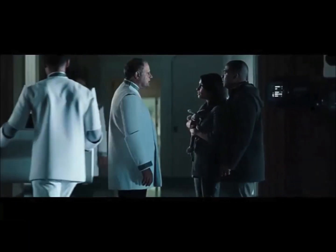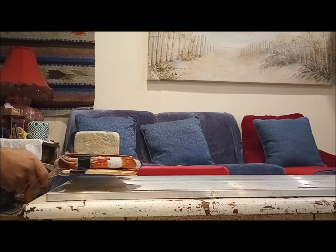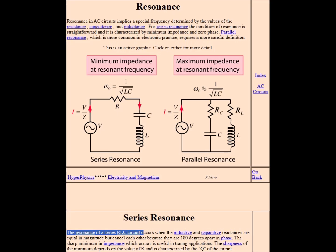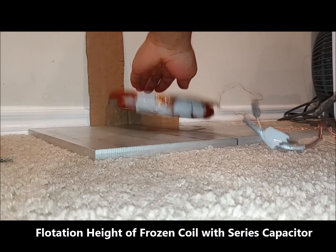In previous videos, I demonstrated the ability of maglev to mimic the flotation characteristics of various anti-gravity-like devices from science fiction, such as Back to the Future 2's hoverboard and the levitating dollies and medical gurneys from Star Trek and Star Wars, noting that methods will have to be devised to greatly enhance energy efficiency. In researching this, I started with the principle of resonance — a condition in which maximum energy transfer occurs between a source of energy and the receiving system due to frequency matching, the source being house electrical current and the receiving system being the magnetic flux circuit. By adding a non-polarized motor capacitor in series with the coil's inductance, a resonant tank circuit is created. Matching the natural frequency of the circuit to the 60 cycles per second house current resulted in a much stronger AC magnetic field, increasing flotation height of the coil by about 60% for the same input power.